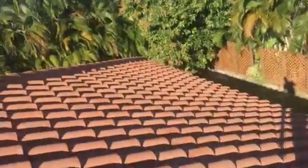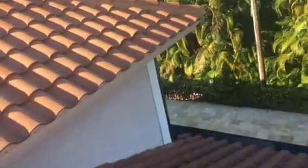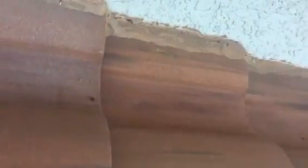Now this area has it, but if we walk back to this area of the home, you can see that this wall on the back side of the home does not have any top flashing at all. Instead, what it has here is concrete, and we can see that that concrete is actually starting to crack. This is bad because water can get underneath there, start to deteriorate your underlayment, eventually rot out your wood, and then cause a leak inside the home like it did on the front side of the home. So it would definitely be recommended to add some top flashing there.